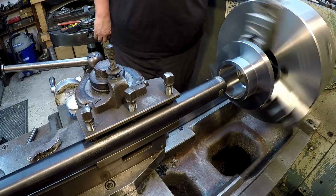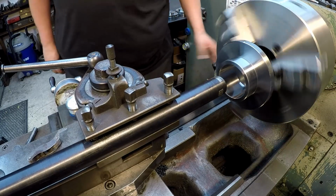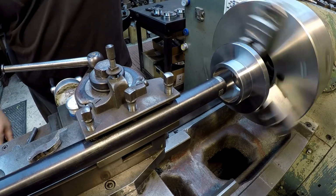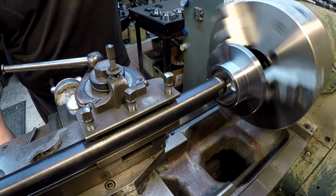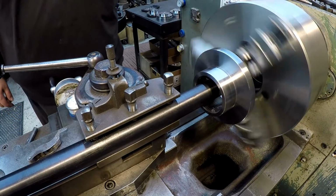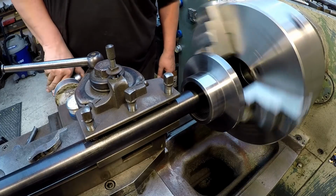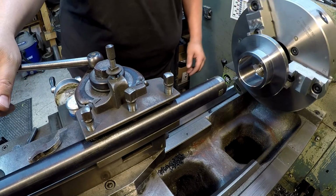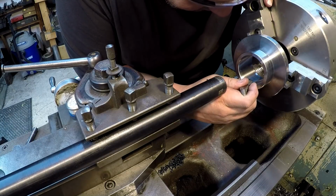Let's go ahead and get it in our thread pitch, which is going to be 8, BD1. All right, BD1. Let's go ahead and we'll make a scratch through there and see what it looks like. Also making sure that everything's clear. Zero, zero. Okay. I got a thread pitch gauge and I'm just going to verify it. And we look good to go.